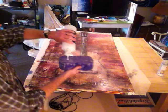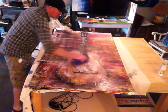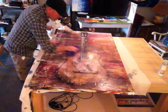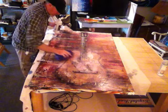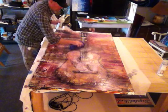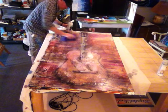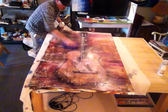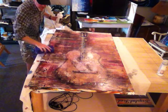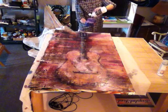It actually spreads a little better because there's already varnish on the sponge. Try to do it as quickly as possible so it doesn't start drying too fast and you don't have to overlap. You don't want to get it too thick either — what you'd rather do is come back over a few times with thin layers instead of one gigantic thick layer.